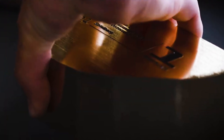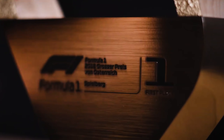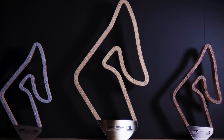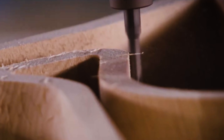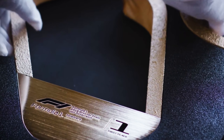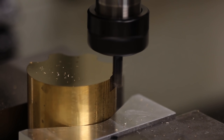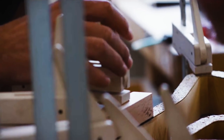The Austrian trophy has three main components: wood, brass, and a golden rough crust texture on the front. The process used to create it involves cutting out the track design using a CNC machine onto beautiful Swiss pine wood, then carving and engraving a block of brass with the CNC machine. That's all glued together with the rough texture using wooden clamps, then polished and lacquered to bring out the vibrant colors of the wood.